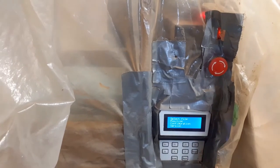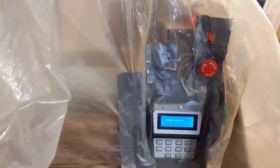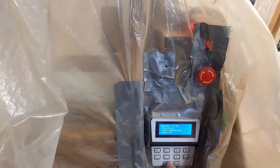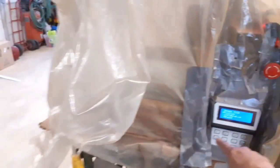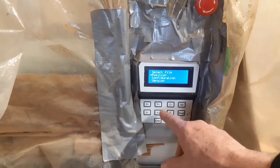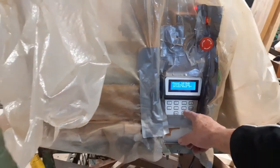Select file - we have a choice: select file, position, configuration, or version. Oh, error 21 - motion reset. You get that sometimes. There's a limit switch issue; we're going to start over again. That's actually somewhat unusual - I probably have to clean something. Back through: cutting tool, workpiece, USB check, enter to continue - select file. Now we have an arrow we didn't have before. We can go to position and I'll be pressing X plus, X minus, Y plus, Y minus, Z plus, Z minus. Those are the moves in manual jog mode.